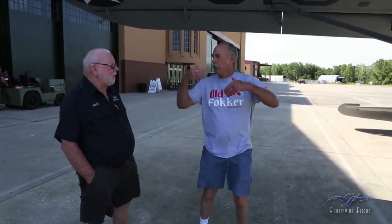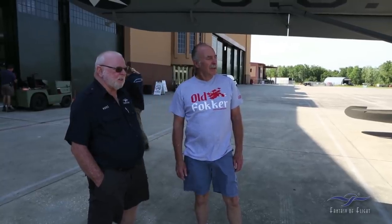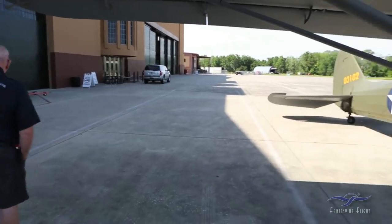Well, and you getting Andy to look at it gives a second set of eyes, and everybody's thinking about it. What is the deal? I think it's got to be off a tooth on the cam, not the mag. Yeah, if it was the mag, it'd be firing. It'd be close enough that it'd be popping. Right. All right. Well, we'll put it on.